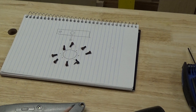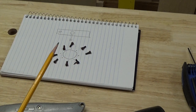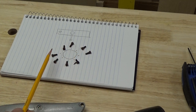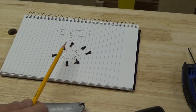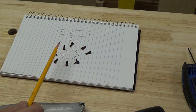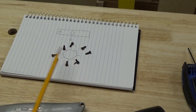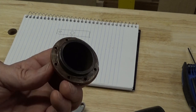Since I've not done a lot of these things before, I made a quick drawing when I pulled this cap off the steam dome, just in case someone had re-threaded and put a different size bolt in there during the locomotive's history. I drew a little diagram and orientation, then pulled each little stud out and put it in its proper place. It looks like the only difference is maybe one doesn't have brown paint on top. But anyway, when you're brand new and just learning — safety first, label everything. The threads and component sizes on this locomotive are really tiny, and it would be very easy to over-torque something and ruin it.